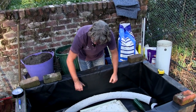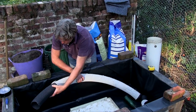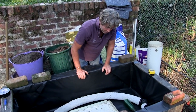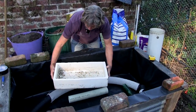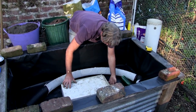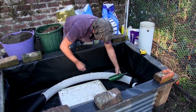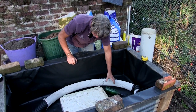We've got the plastic in. I've also got a couple of old bits of ag pipe with slots in them - they'll just act to help the water move around. Another thing you can throw in, just to save yourself a bit of material, is some type of void former. I've got an old poly box here - just make sure you put a hole in it so the water can rise up inside it, which helps hold more water in that space. You could use an old bottle on its side too - it's just a void for water to go.